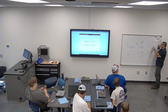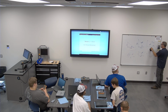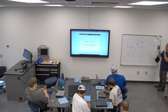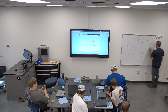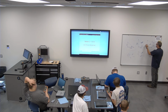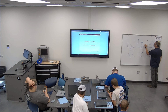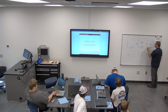Okay, so do 21 degrees. And then do hypotenuse. Nope, you already did the 21 angle. And then you do 5.25 hypotenuse. And then you can push the adjacent or the opposite buttons. 4.901 thousandths, or the opposite. Or the adjacent, so give me the other one. And then the other one should be something like the other button. 881 thousandths. That seems right.